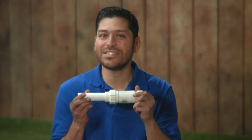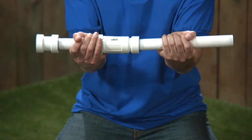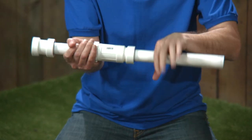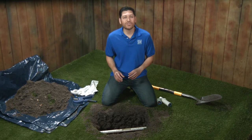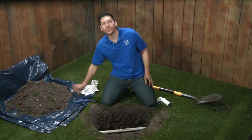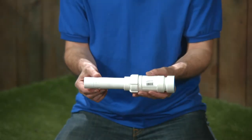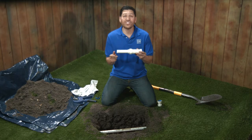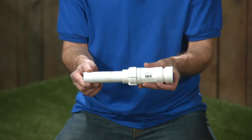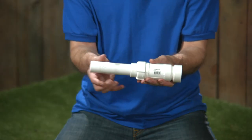The cool thing about the PVC lock system is that it requires no glue. You just slide it in like this. The fitting can even be rotated after installation. And removing it is simple — you need to purchase a PVC lock release tool the same size as your fitting. You'll notice that this end of the slide fitting is essentially one inch tubing, so you can add any variety of fittings on this end. And because it slides back and forth, I won't really have to be picky about what length of pipe I need to cut out.